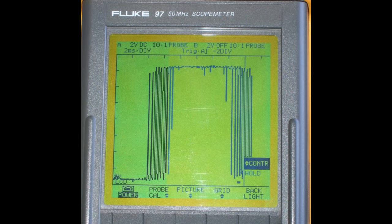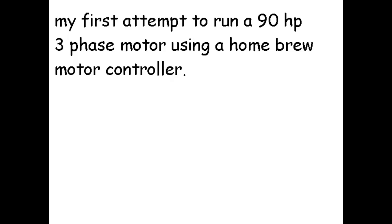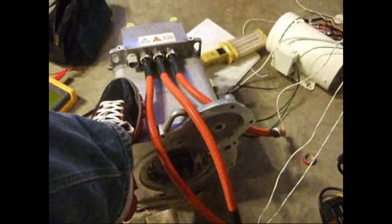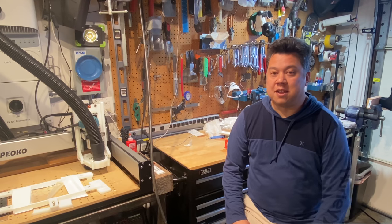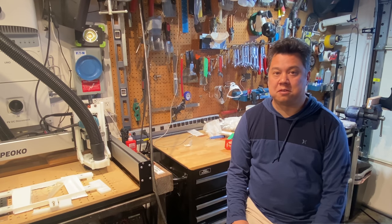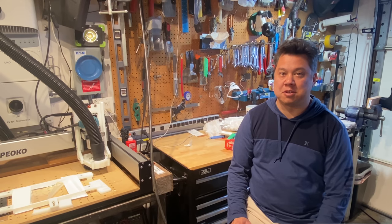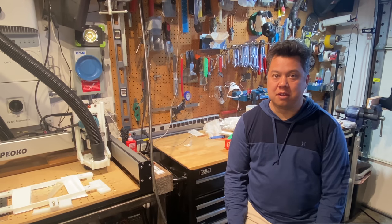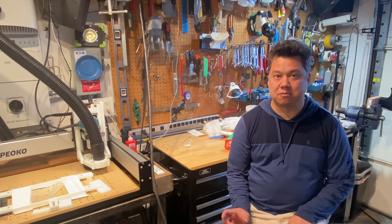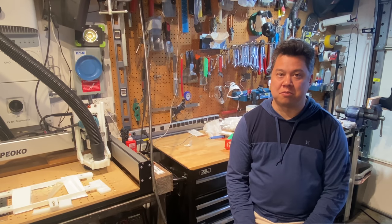What you're seeing on the screen is the top half of the sine wave. In the next video you'll see my first attempt at spinning a motor with the larger IGBTs — looks like I blew a fuse. That mistake actually fried the IGBTs, but I learned from it: I had too much inductance between the DC bus caps and the IGBTs, which caused voltage spikes to exceed the voltage rating of the IGBTs. On to round two.